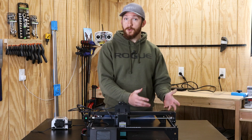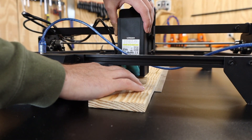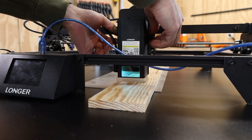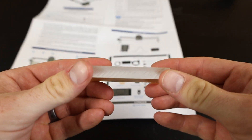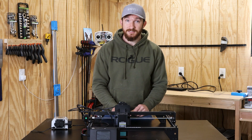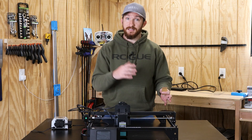The second thing I found confusing in the instructions had to do with how to focus the laser module. It does cover it, but it just says to place the focus plate on the material, drop the laser module down to the focus plate, and tighten the thumb screws. That seems pretty easy, but the instructions weren't clear on what the focus plate actually was, so I had to assume it was referring to this quarter-inch piece of acrylic that came with it — it was clear instead of black, which confused me.